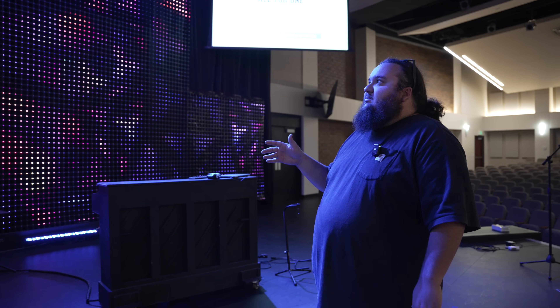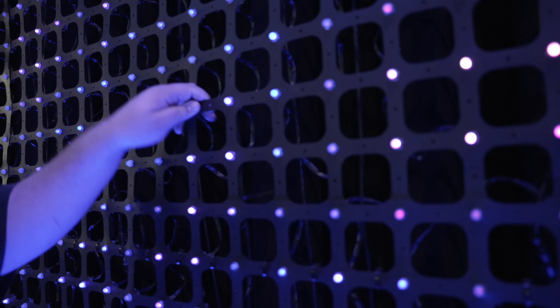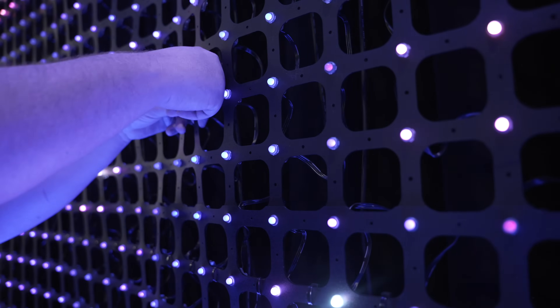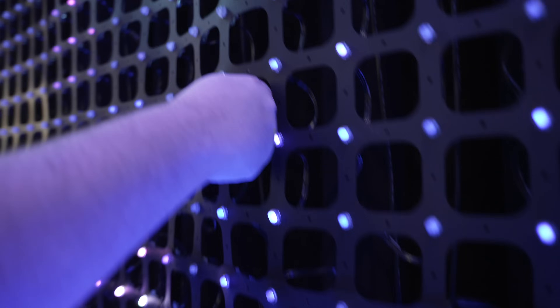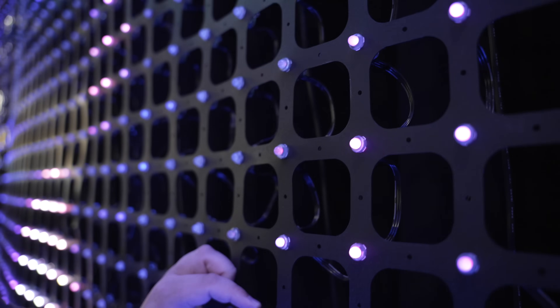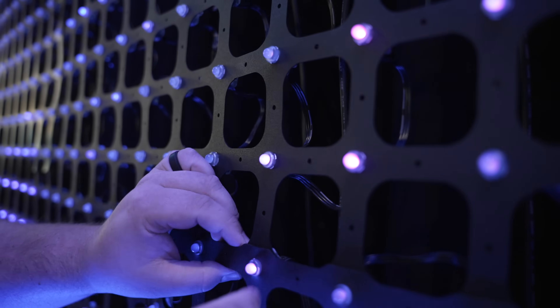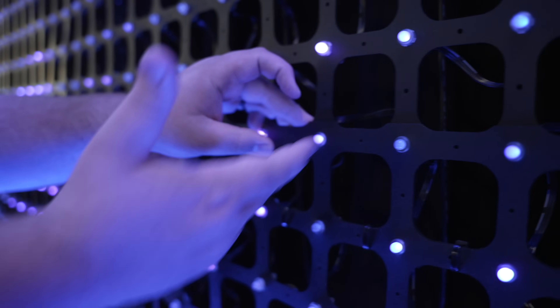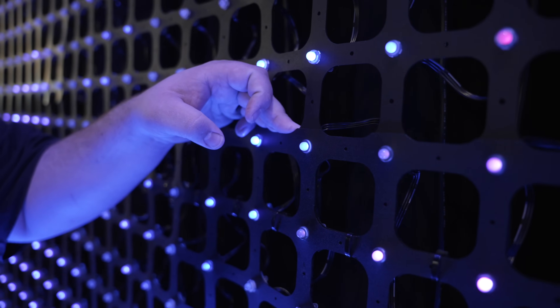That company has a product called Pixel Node Net, which gives you perfect three-inch spacing and comes in four-foot by eight-foot sheets. It's essentially landscaping plastic. The LEDs just punch through. You can overlap the sheets together — I overlapped them by two and punched the light through both layers. At that point you essentially have a bunch of Lego bricks that you can connect together.